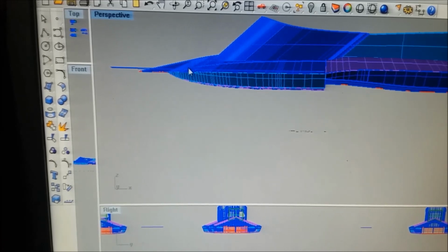And if you start getting into waves that are 3 feet high, you shouldn't be out there in the first place. Because if you get there and the wind picks up and the waves pick up, you roll up the garage door, and the front is pretty much open. And they're wave-piercing pontoons basically on the side. The point is lower than the center line, so the water can wash right down over that lower deck and out the back. You don't want to put 10 tons of water in something you're trying to float, especially if the water's rough. And then there's 4 staterooms on the next floor and a party deck on the top.